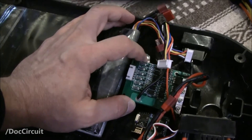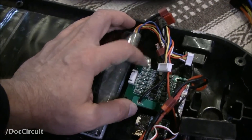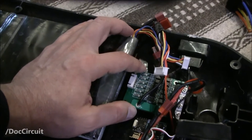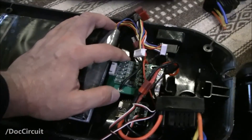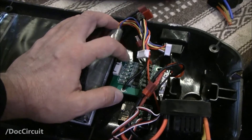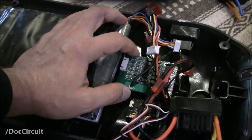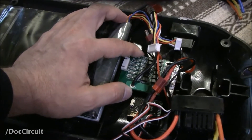But I'm not sure you'd want to do it. If you remember from previous videos, this is a weak part — it blows — because it's trying to restrict the current going into the motor, and it'll still be doing that job, so this weak point is still going to be there. I wouldn't pursue that; I'd get rid of this completely and do off-board charging.